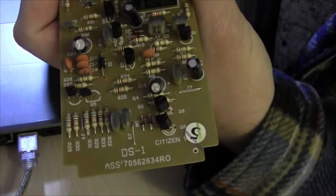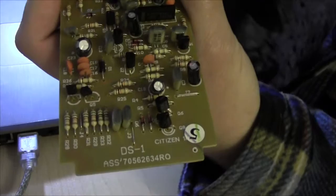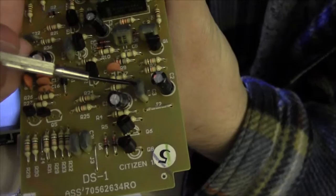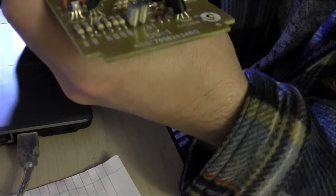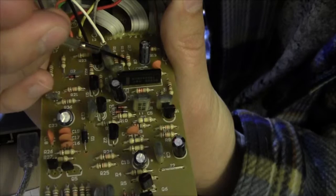As for the JCM, you need to look for a few more things, and I'll show you them here because I didn't do that in my previous video, even though everything's in the description. So you start with this capacitor right here, C3, change that out to a 33 nanofarad, or 0.033 UF. And then you're going to go to this resistor here, R17, swap that for a 15 kilo ohm resistor.